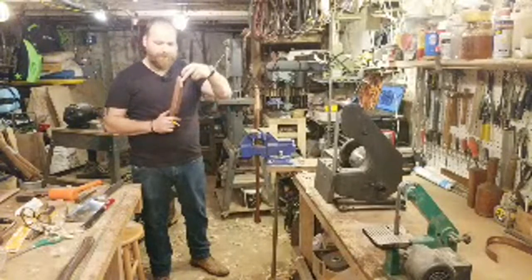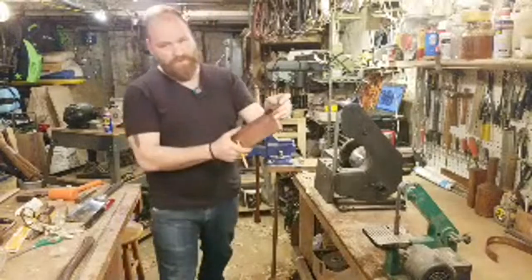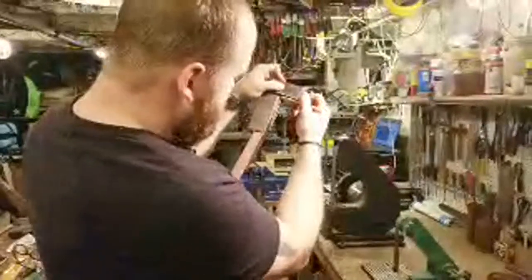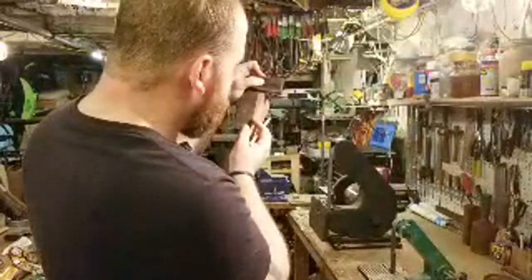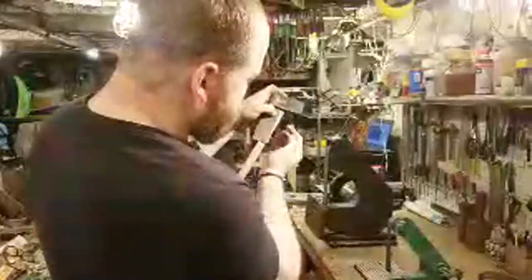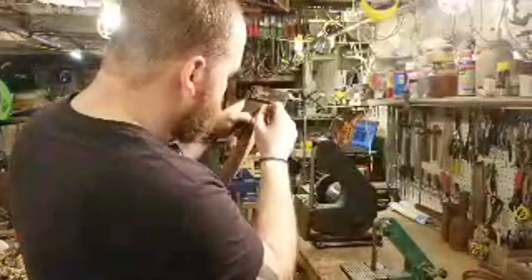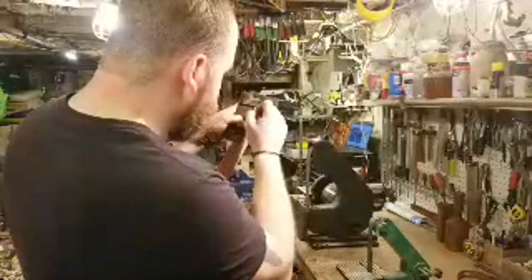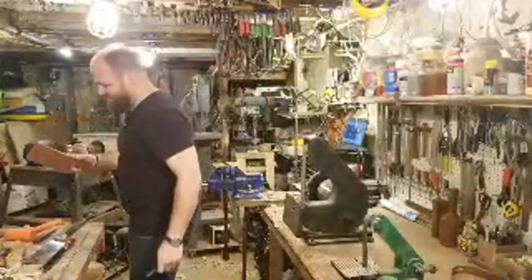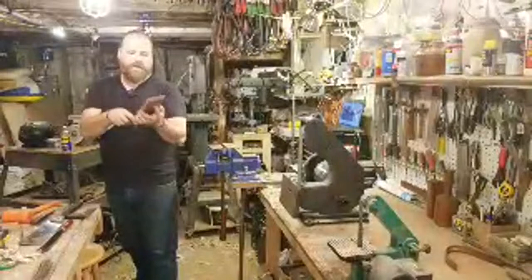Okay, now I'm gonna go about a little bit more than 1/4. Let's go this way. Now what I'm doing is I'm drawing an angle. So I'm gonna create my wedge. I'm gonna cut this on the bandsaw and I wanna bring this down. I don't wanna go super narrow, but I also don't wanna go super wide, and I'll do a little changing to this once I get it going, but that's maybe 3/8 or so of an inch. I think that's probably good. Nice wedge. That should be a good starting point, and I can kind of do a little bit of changing from there down. So we'll trim this up. Clean it up a little bit first on the bandsaw, then trim it tall on the bandsaw, and then on the grinder.